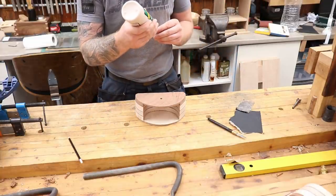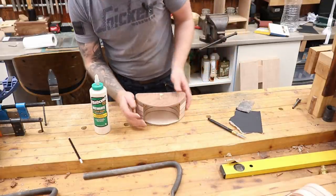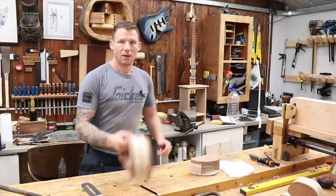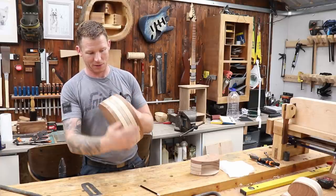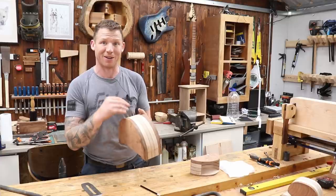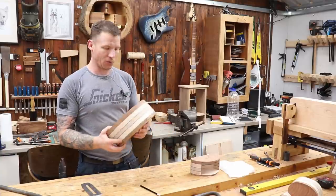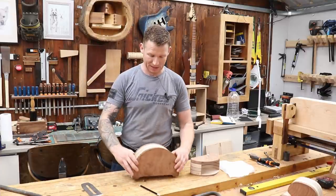Just a little dab of wood glue on the handle tenon — that should be good to go. I'll flush trim off the bit of tenon protruding through and give it a light sand, and that should look pretty good. The box is out of the clamps and the back is glued on — good and solid after a couple of hours. I have a lot of work to do on the outside to smooth it all out and remove the lumps and cut marks. I'm going to use the spindle sander to smooth the outside and then hit it with the orbital sander. When it comes to fitting the drawer, we might use the router to even up the gap.